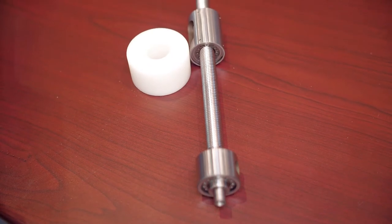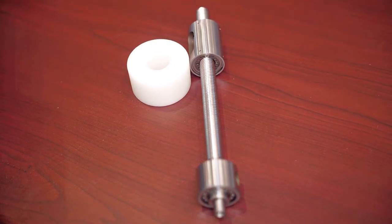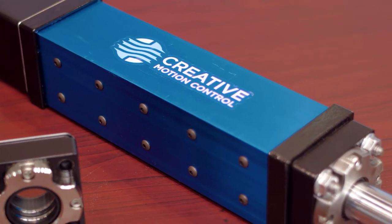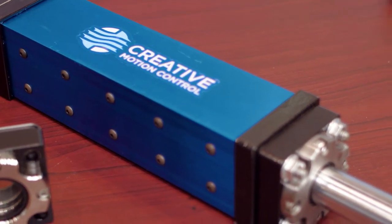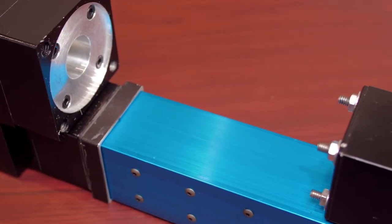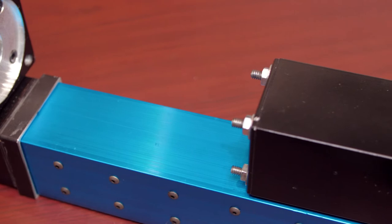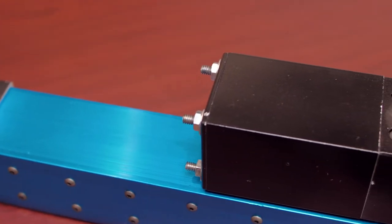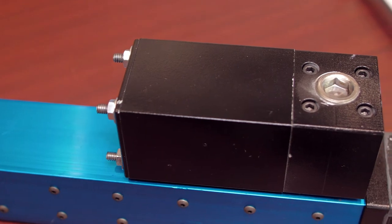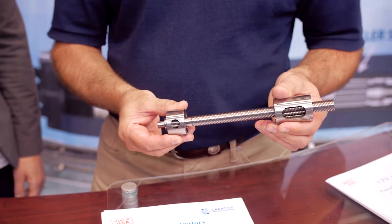I understand that these are also lubricated for life. The actuator line, the CPD line, is oil filled. Lubrication is a critical issue in roller screws — they go really fast and really high loads, so heat is an issue. When we created our actuator line, we made sure to deal with that lubrication issue the best way we could, and that is to oil lubricate. We've completely filled them with oil so they can be oriented in any direction, so you never have to touch them — there's no maintenance on them.